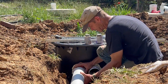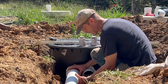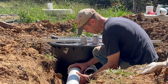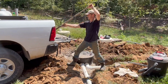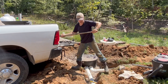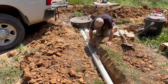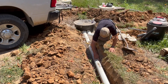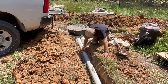We are now gluing the sewer pipe to the filter — this will be the intake, and right next to it that's the outflow. So right now we're working on the inflow. Words of wisdom? Pick a cooler day to shovel rock. I want this pipe to be really stable, because sometimes dirt does not get in there and it leaves a gap below the pipe, which when you walk on it is going to crush and break the pipe. So I'm going to make sure I get a good bed that this fits on.